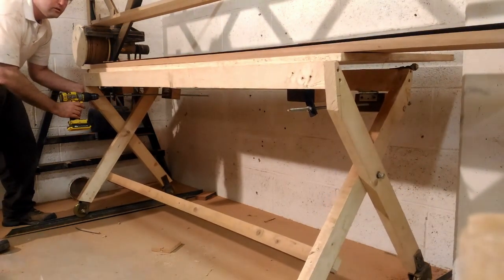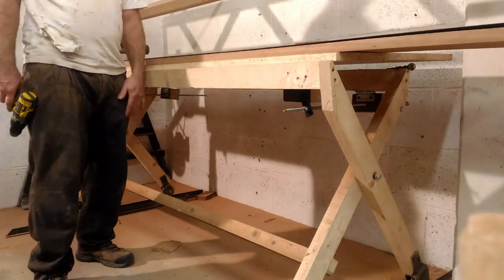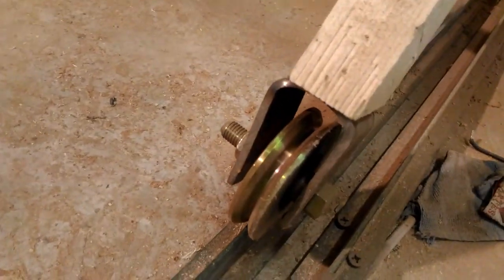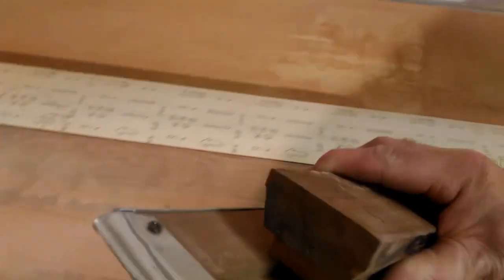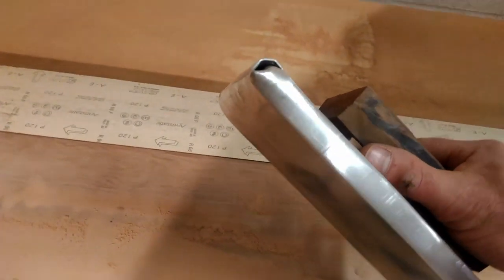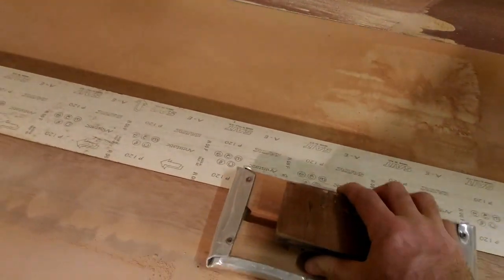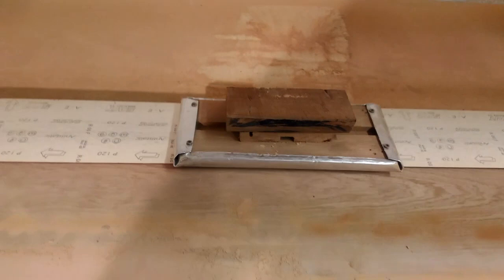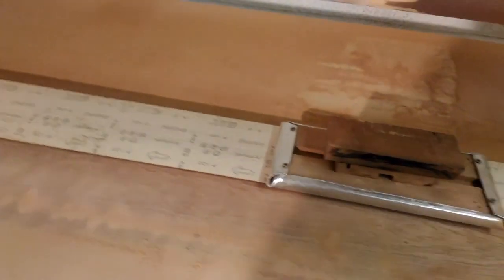The idea is you want to support the belt — just drive and feed the belt. As you run it, you have some minor depression on it. These are wheels — I've mounted a ball bearing with a groove, and the groove runs into this track. It's just a piece of very slick, thin stainless steel, and it's got a little grab handle on it. It's very important that you carefully round off all the corners, because if you've got a corner to catch, I lost a belt because of that. At some future time I'll probably make this so you can use one of those handheld sleds that runs on a track, so you can go back and forth — that might be a future project.